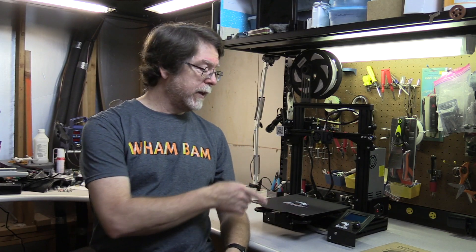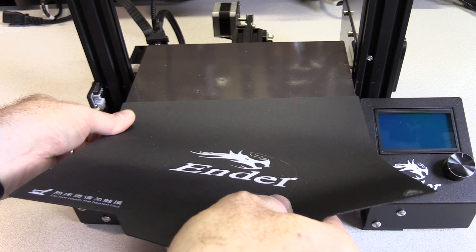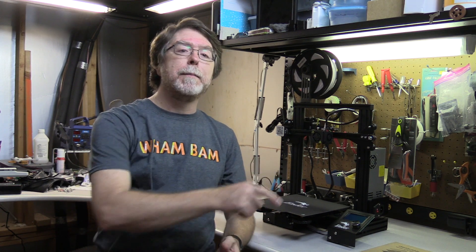The Ender 3 Pro comes standard with a C-magnet flexible magnetic print surface, and while it's a good product, sometimes it can be a little finicky when it comes to placement. Both the removable part and the base are magnets, and they have a repeating pattern of north-south magnetic poles. The two parts have to be aligned or the magnets won't hold well. Occasionally I've had issues printing tall, skinny parts where the parts are sticking well to the print surface, but the magnets aren't sticking well to each other, and the C-magnet sheet starts to act like a hinge. On the Wham-Bam system, only the base part — the part that you peel and stick to the heated bed — is a magnet. The removable part is a spring steel sheet, and since only one part is a magnet, you don't have to worry about perfect alignment to get the two to stick.